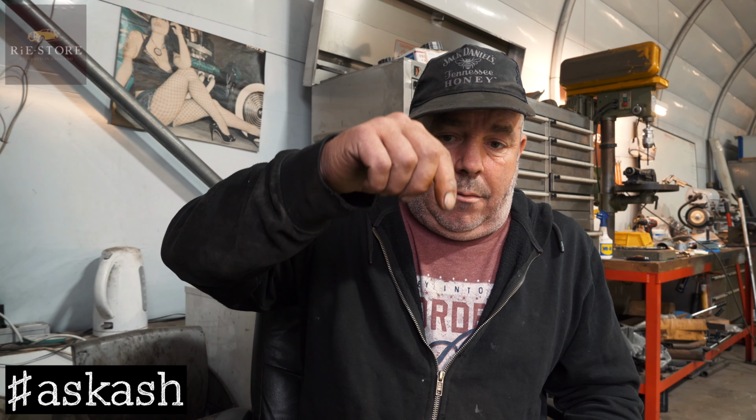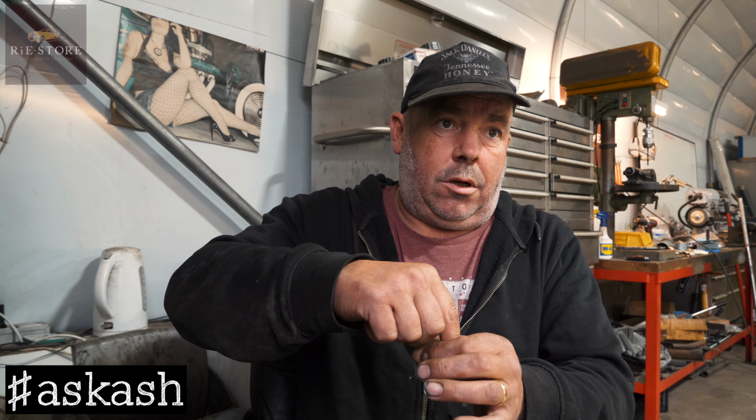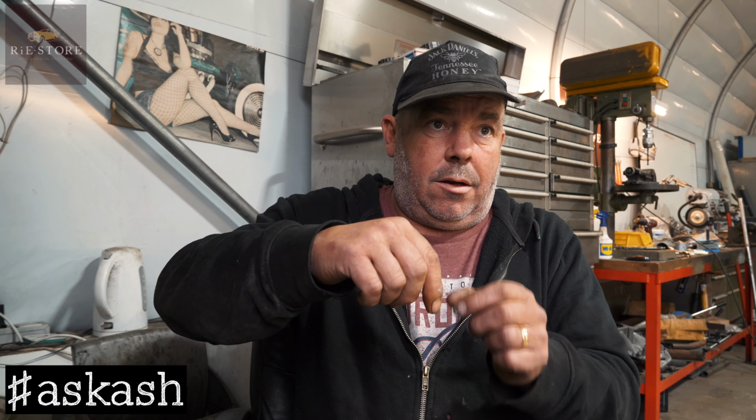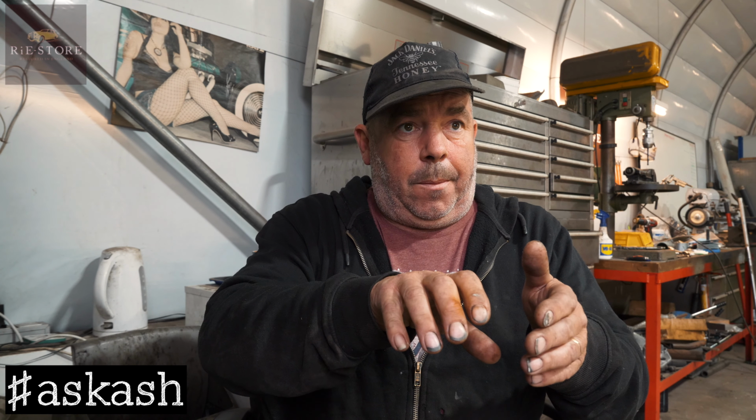Then in that, you've got a pin that goes in, and then there's a circular washer that goes down over the pin, that only goes on one way. The bottom's flat, the top is tapered like that to match the circle of your twist grip. Okay. Put all that together, make sure that that all moves freely. Then they did do some with an extra washer on the end.